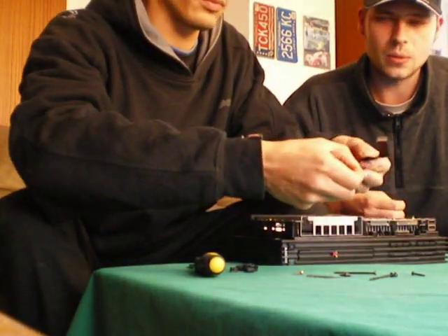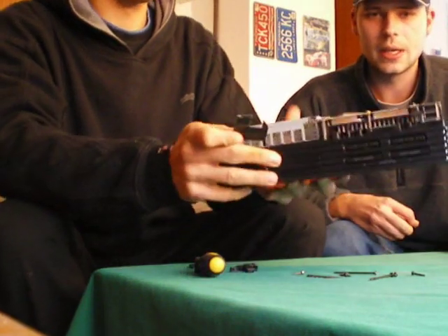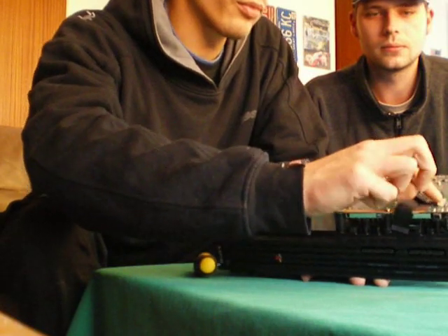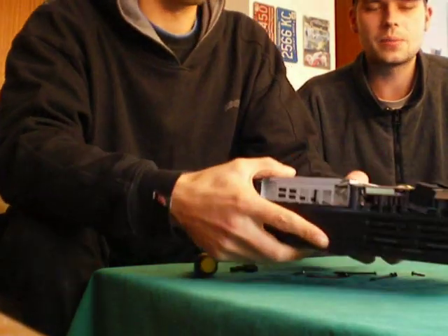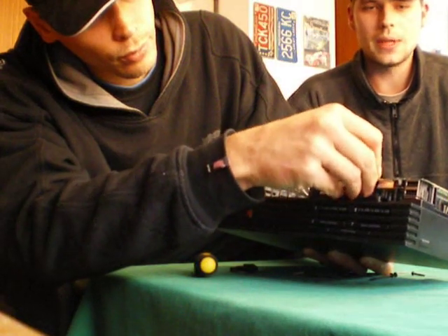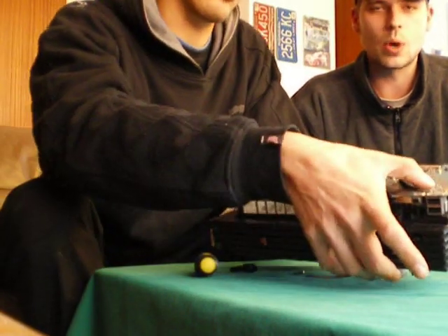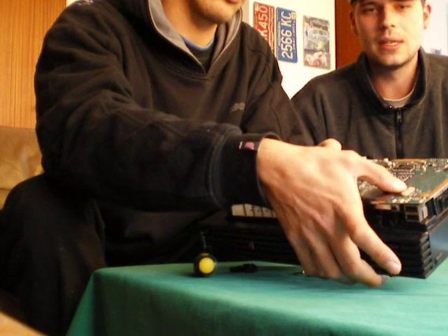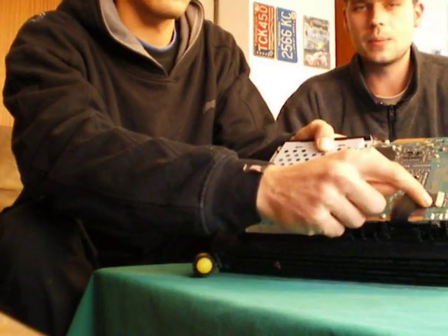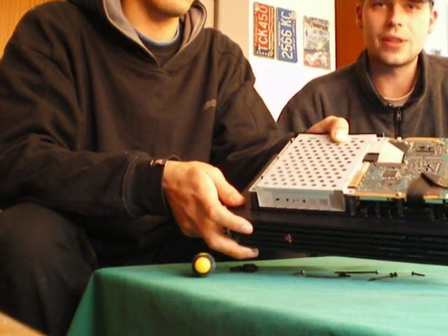After that, we popped the cable back in — into one side at the controller port and of course on the board. At first we had a problem: we tried it out and it didn't work — neither one of the controllers were working. So we opened up the system and ran it open, pressed down the cable onto the contacts, and it was working fine. The problem was that the cable was now a little bit too thin at the very end. So all we did was use basic clear duct tape and tape around it a little bit, so it gains a bit more thickness.